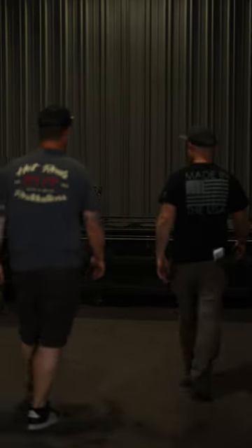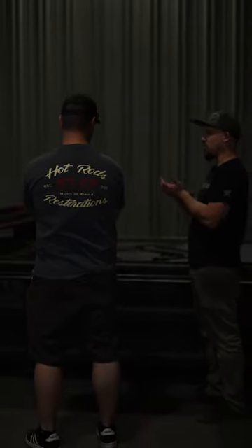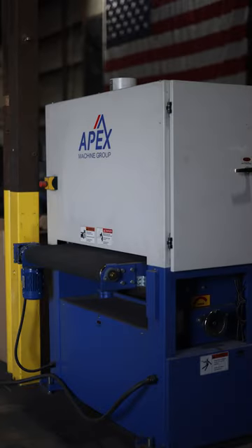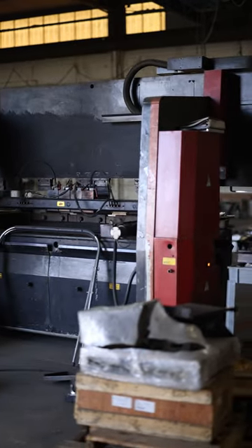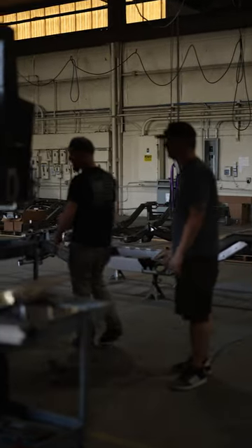You can see some of the skeletons left over from the plasma cuts. From there, they finish-sand all components before further processing — it goes through the easy sander, giving a nice finish before moving over to the press brake. At the press brake, everything is formed off of in-house designed prints — a booklet of endless parts that go through here.